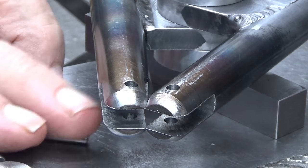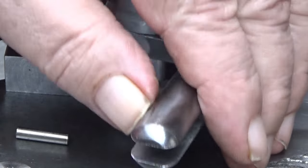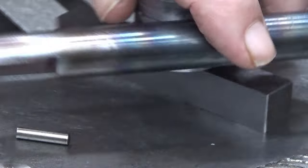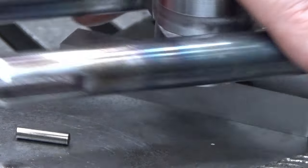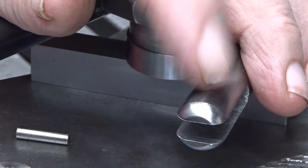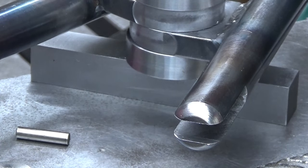Okay. So the next step is to mill here a recess with a 16mm end mill, and it's very similar to the operation I made here, but this time I won't move it. I just push it in so that there can be a 16mm thing inside there, and it will be 8mm deep. Oh well, that's quite simple. I'll come back when I have set up this mill for that operation.